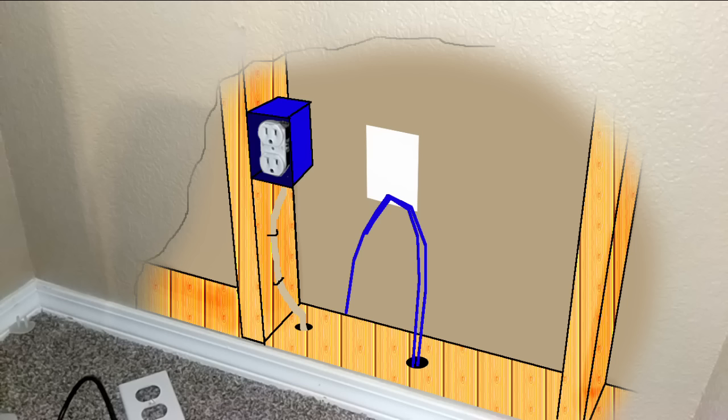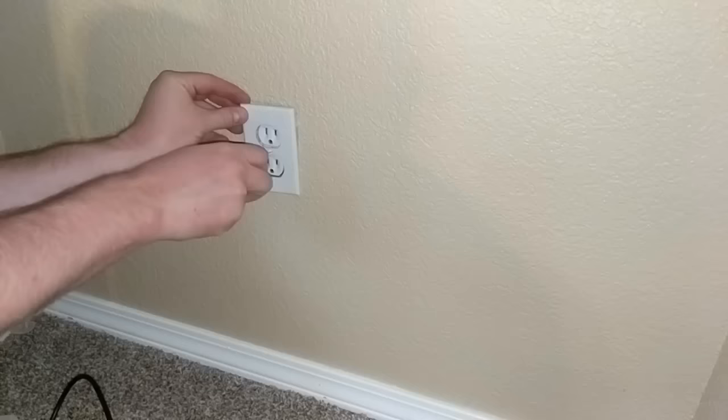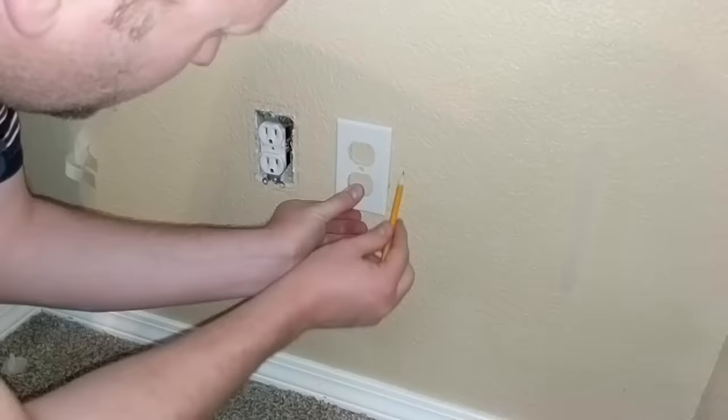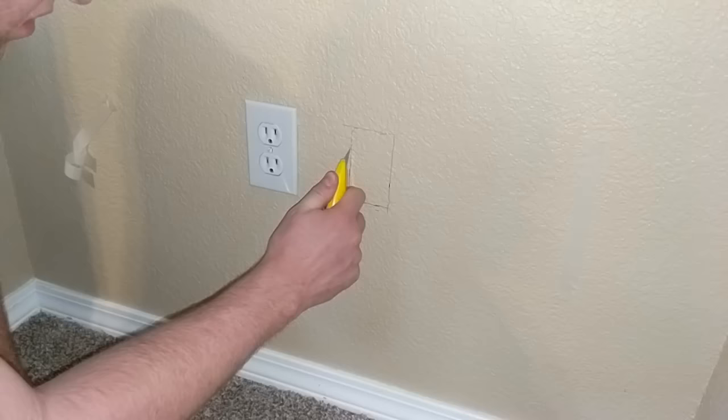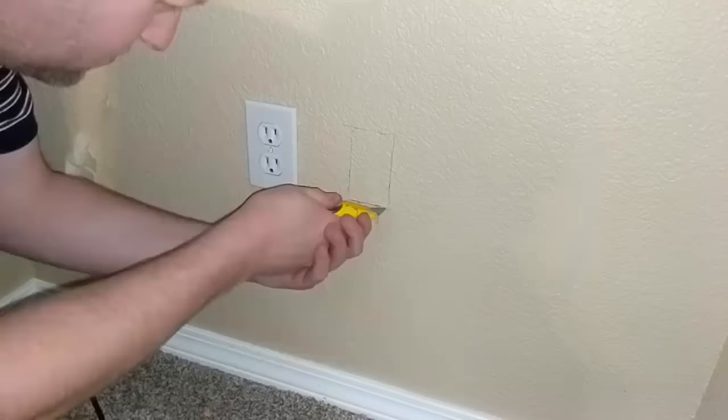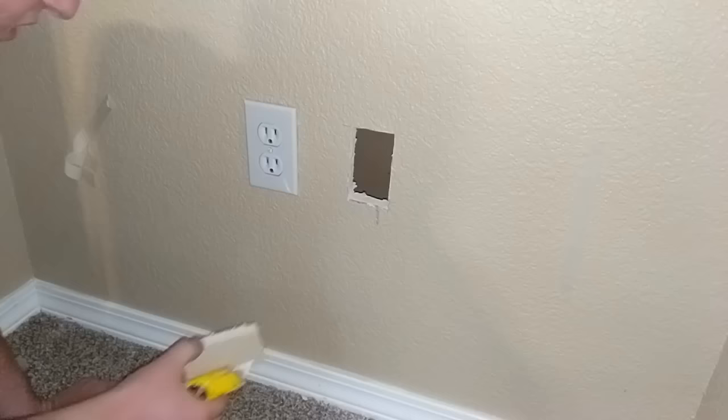I plan on drilling a hole in the base plate and running the cable up from the crawl space. Now it's time to actually cut the hole in the drywall. I pulled off the power outlet cover so I can see the location and size of the hole I need to cut. I measure to get the same size and keep them aligned, then mark it. Once I have the hole traced out on the wall, I begin to cut. Carefully using a utility knife is one way, or you could use a drywall handsaw. It's easy to slip when starting a fresh cut through drywall, so I apply very little pressure the first few passes, then more and more as I go over it again.